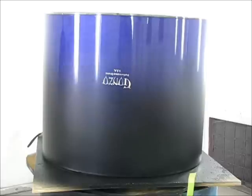Now, this decal is probably the thickness of a couple coats of clear. So we want to put at least 2 coats of clear on it. Sometimes I put 3 or 4 just to build up the clear in that area considerably. And then we'll apply the 3 to 4 coats on the entire shell. We're going to put 3 or 4 just to give it enough thickness so later when it does suck up into the wood grain, we've got plenty of clear to sand it down slick again.